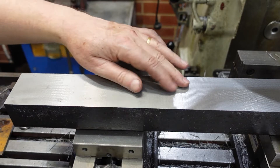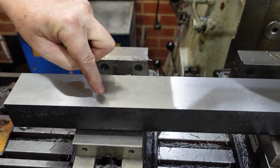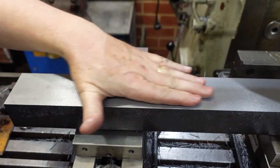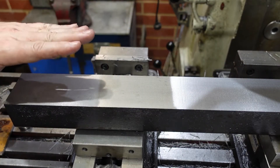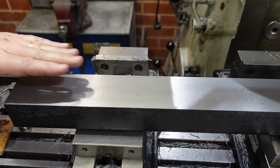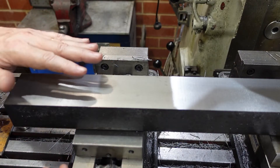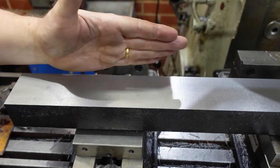One of the things I really like about cutting with a slab cutter like this is the surface finish. It's quite unusual — if you imagine using an end mill you'd have lots of scratches, whereas this one gives you a sort of uniform ripply finish. It's quite pleasant. I'm going to flip this over and machine off an equal amount on the other side, because it's good practice whenever machining bar stock to take equal amounts off. If there are stresses in the surfaces and you machine one side heavily and not the other, it can tend to banana a bit. So machine equally from both sides.